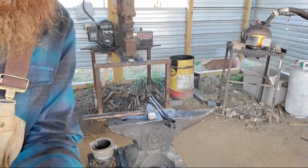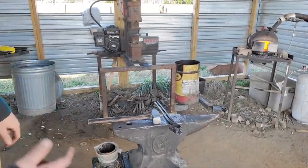I wouldn't want to do that, Curtis. I mean, maybe it would look cool. But I wouldn't want to put finger grooves in the tongs because you've got to be able to turn the tongs in your hands and hold them in different positions as you're working a piece. They wouldn't be very comfortable unless they were held in that exact spot, unless you plan on never turning your work. As I'm working, I'll show you. I'll let you watch my tong hand as it's rotating.